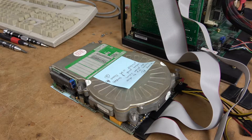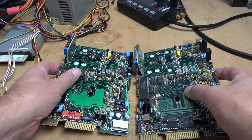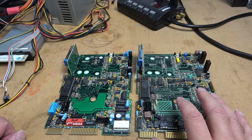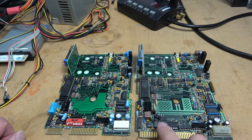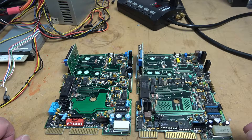Then along came a killer deal where I picked up eight Microscience half-height drives. When I got the drives here in the lab I decided to test them — I wanted to see if they would work. As I was testing the drives, two of the control boards caught on fire. It turns out they were all of a specific revision. This is one that I recapped because it blew this capacitor here — nice big fireball, stunk really bad.